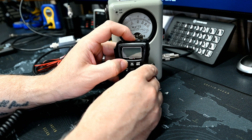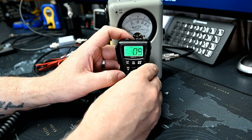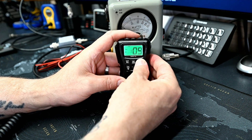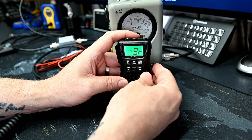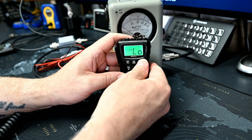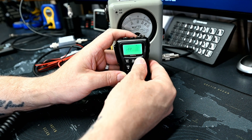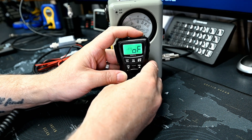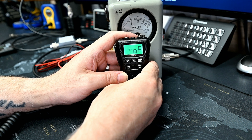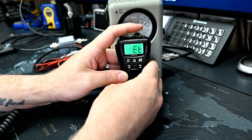In the menu in expanded mode, there are two new options. You now have RF power, which can be switched to medium or high. A bit further on you have minus 5K, which is your 5 kHz decrement option. Those are the two additional menu settings available in expanded mode.